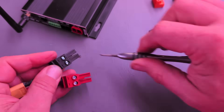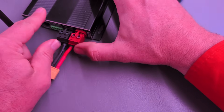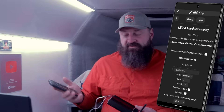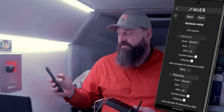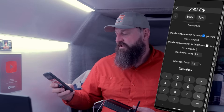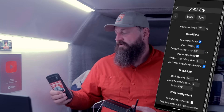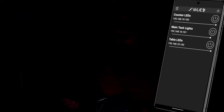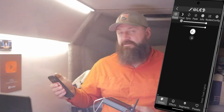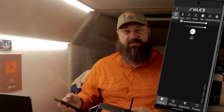Installation is just as straightforward as the others. I'll temporarily supply 12 volts to the power terminals — these are seriously overbuilt and can handle far more than the 10 amps I'll be using. Then connect your LED light strips to the output terminals. For now I'm only using two of the outputs and will wire in the rest of my lights later. Then I'll power it up, join its access point, enter the Wi-Fi credentials and LED preferences. In my case I have two channels set up on GPIO 32 and 33, and I'll set the transition time to three seconds. Then I'll turn off the colored LEDs, turn on the new white LEDs, and you can see just how buttery smooth these transitions are. Oh wow — such smooth, very transition, much dimming.